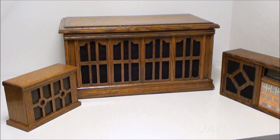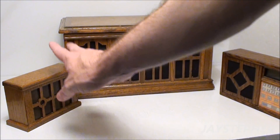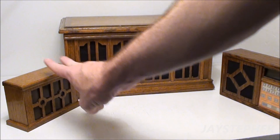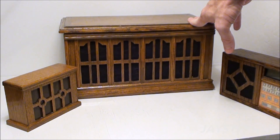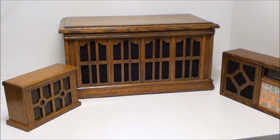I'm thinking of testing these out in a later video and seeing how I'm going to approach getting them fully operational and back into service. This one I know is a good performer — I think the tuner and volume are just scratchy. The one in the back is obviously dead, so that's my main focus. I'm going to have to realign it, which means bringing out my signal generator. With very little service info since these are home-built, that's going to be tough.